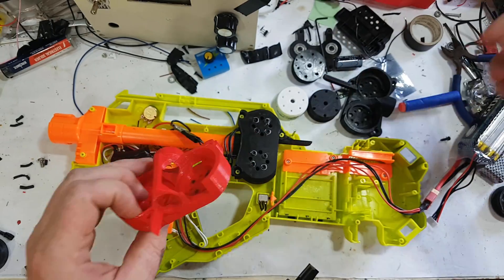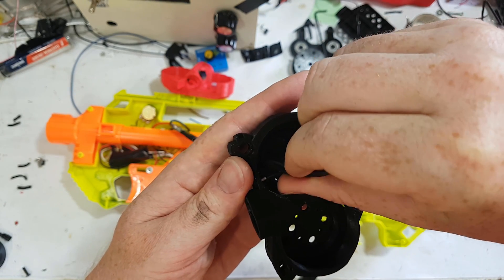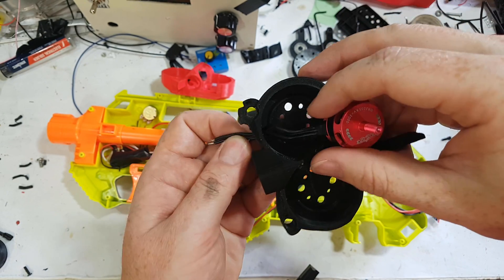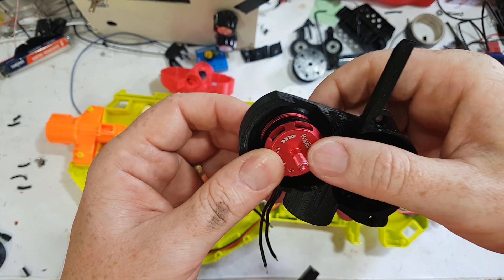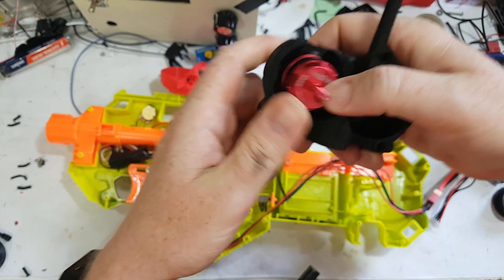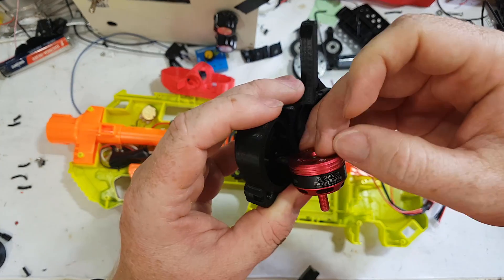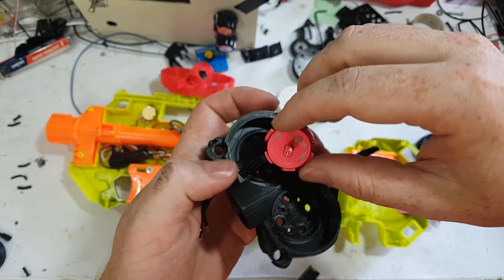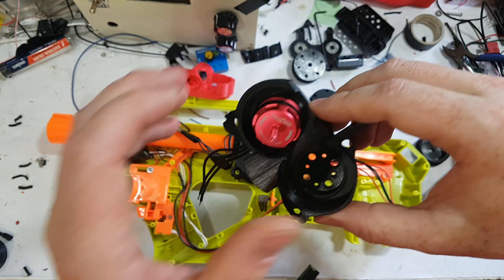Because it gets a bit warm, in Generation 2 we've encapsulated the motor with this ring here. That means you theoretically don't even need any screws at all, but obviously that's not true — put screws in it. It goes in like that and you have to push it in to get it seated, normally by putting it on the table and using the wheel to push it down. All the red aluminium on the side of the motor is now pushing against the inside of the cage, so when that force gets applied it's much harder to deflect, bend, or slowly move over time.